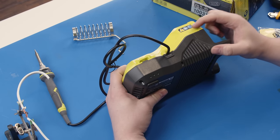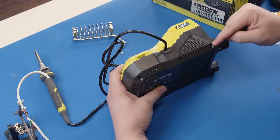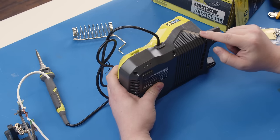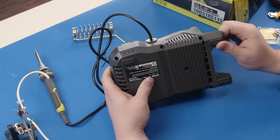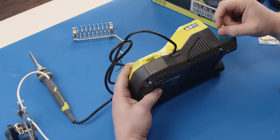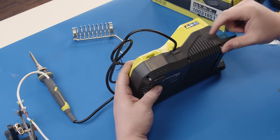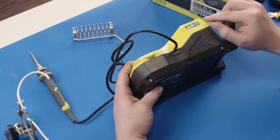One is you get real long screws, so that when you screw them in, they go in like this, and then the heads are sitting down here at the bottom, and you can get at them with any old stubby screwdriver. But if that were the case, you'd see the heads right there, and you don't. They chose the cheaper option, getting the little 1-inch screws, so the head is all the way up here, and you need a long screwdriver to get in there.